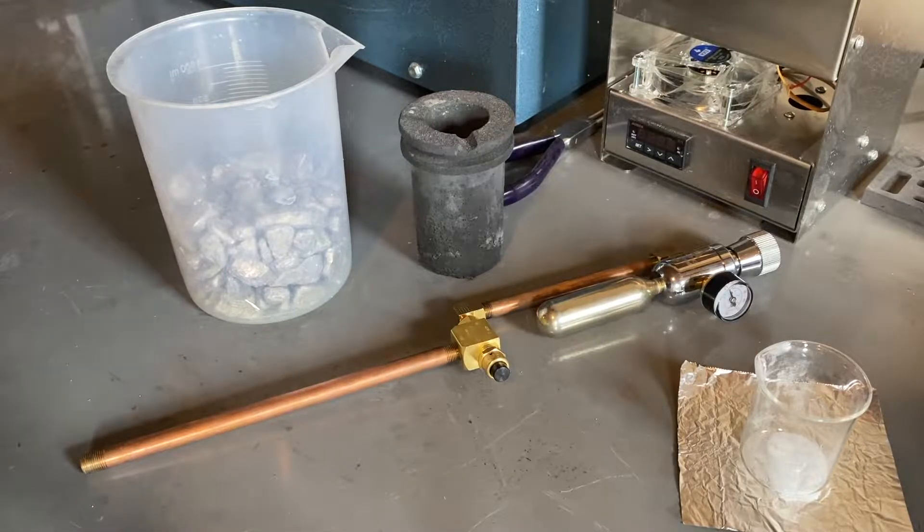The way hydrogen gas can be dissolved into the aluminum is by having water introduced into the molten aluminum before it's poured. Water reacts with molten aluminum to produce aluminum oxide and hydrogen gas, which is dissolved into the aluminum — and that is the issue we're trying to solve.